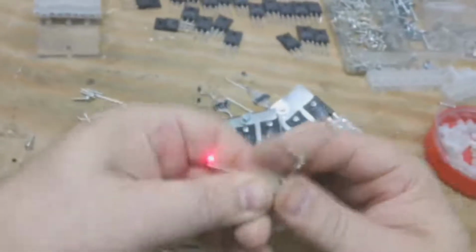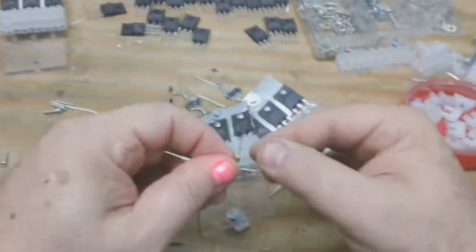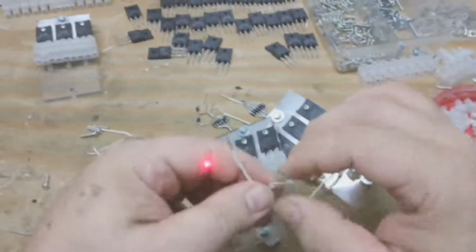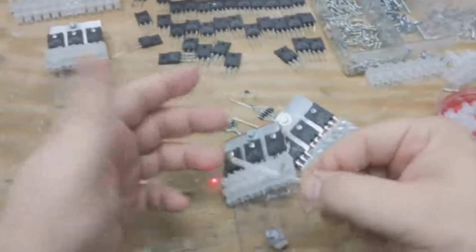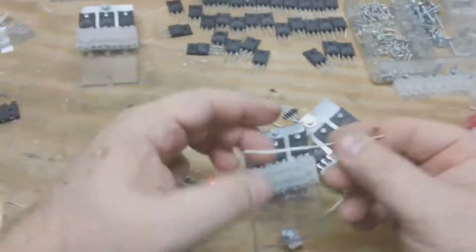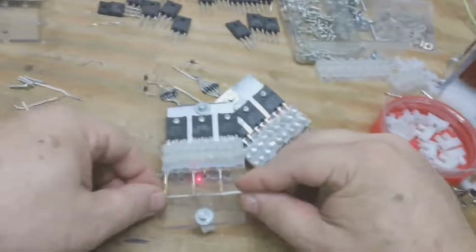Now I've made these for the cart motor, if you've seen the videos, and it really works well because if it doesn't have enough torque, then you drop the resistance. If you want to raise the voltage, you increase the resistance so you don't overload your trigger. And this gives you the ability to be a little flexible, even though the way this is set up, it's not as flexible as a Bedini, because each individual coil does not have its own rheostat. We're using voltage instead. So, okay, we're going to check that and see that, yes, that will work right there.